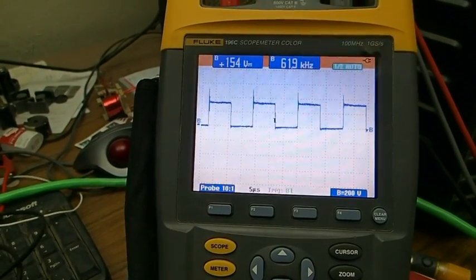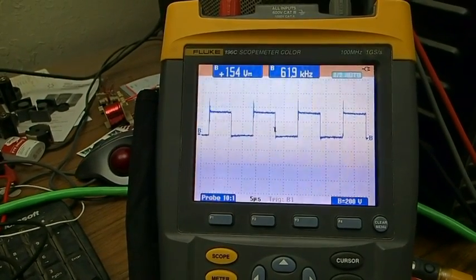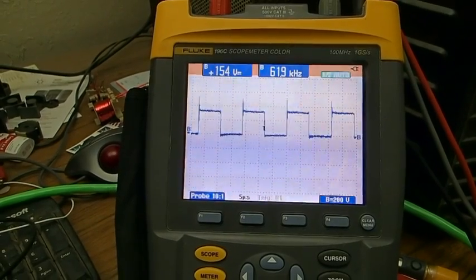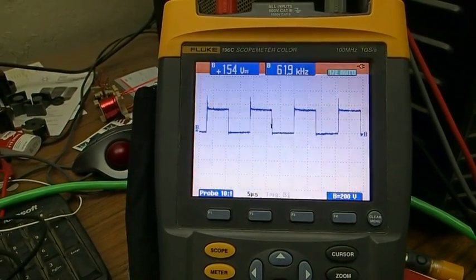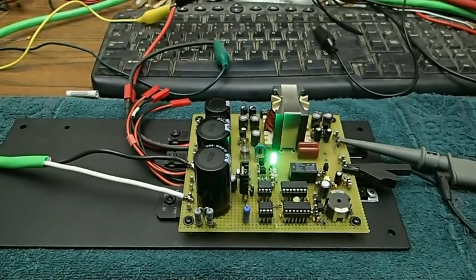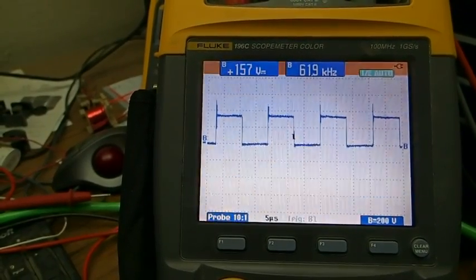Back to the scope — we're switching clean at almost 62 kilohertz. Now I'm going to set up to short circuit this output to test the short circuit protection circuitry. The voltage looks good and the frequency is right on. No problem.